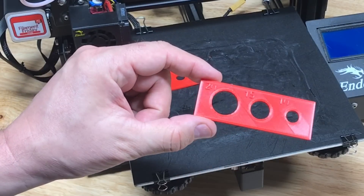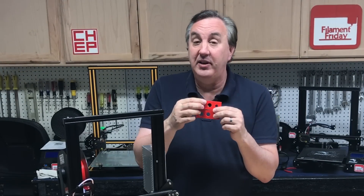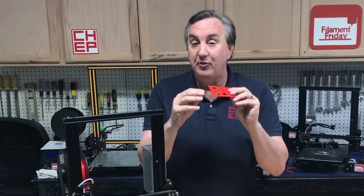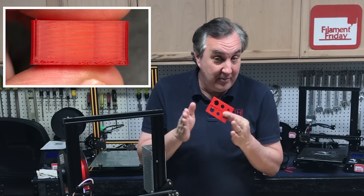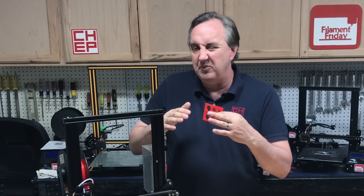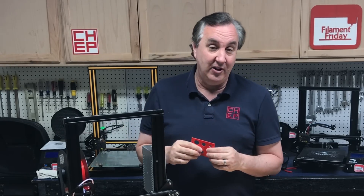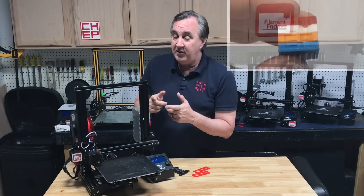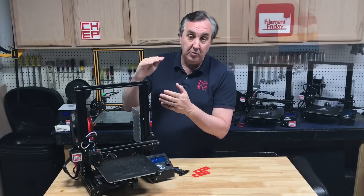So that I can deal with — I can make the text a little bit bigger. But getting the holes perfect without affecting the outer dimensions, that's what I love. That's a nice feature to have in your slicer. This is the first feature of 4.6.1 that I've been able to dive deep into. Another one is expansion on just the first couple of layers — that way if you have elephant's foot on your prints, you can eliminate it by reducing those first layers.